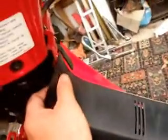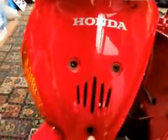I decided to take all these panels off. The order in which these come off is this one first, because it clips in under. Take the screw out of that and remove it. Then this one here — the screw out of there and the two screws at the bottom end, and then it slides down. It sort of slots into these slots here, so just slide that back down and lift it out. Then the next one to come off is this front one — three big screws in there with washers, lift it off.